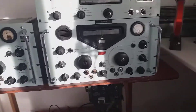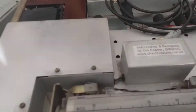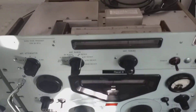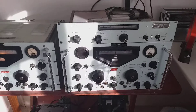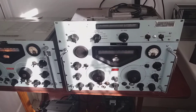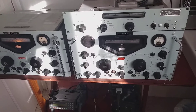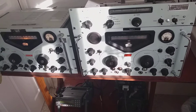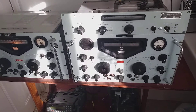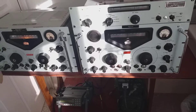Normally you would need a converter, a low frequency converter like this one here. This one has been completely refurbished by Ian Roper, GM0UHC. It isn't connected at the moment, but to use it you have to connect it to the two ports on the back of the receiver and connect the AC to the AC inputs. It's not complicated, but it means you have to do some switching between the converter and the receiver. I was told the RA-117L loses a lot of gain below 980 kilohertz, which is why they make the converter.